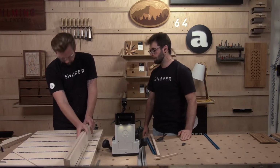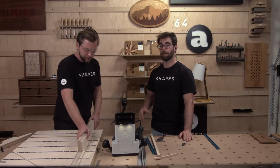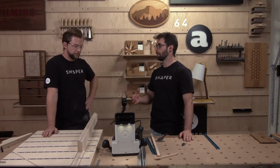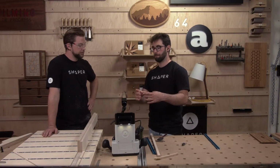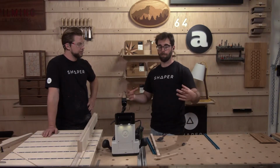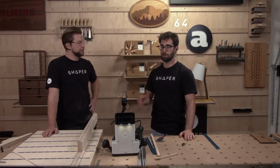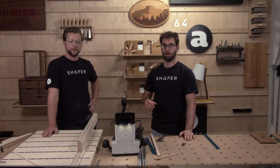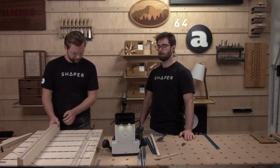One thing that we do typically with our hub projects, so that you don't have to chisel out the edges, is any pocket that you have a square piece fitting into, especially if it overhangs or comes right to the edge of a project, we would overhang that pocket by half the diameter, or the radius, of the cutter so that you just extend past and end up clearing all that. But it's not a big deal to chisel something out. We like working with hand tools too.